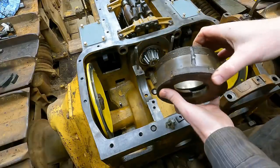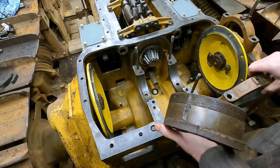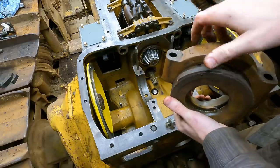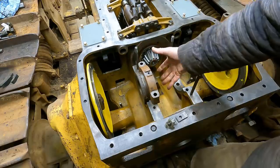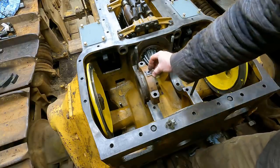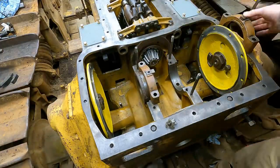I've got a spare one here so I can demonstrate. Basically there's an oil hole here which lines up with that hole down there, and then there's a notch here — there's a little key on here. This is the bearing cap, so that lines up in there and allows it to slide back and forth. What you end up doing is putting it in here, and then you have those giant yellow nuts that you tighten or loosen to set the proper backlash. Once it's set, then you have this that goes right in here and it locks — it locks in the teeth of that nut.